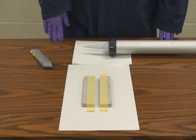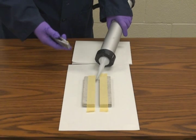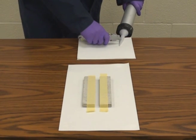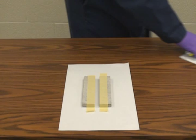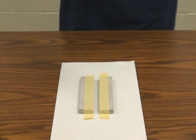The first thing you're going to need to do is to cut the nozzle to fill the gap. To ensure a proper cure, the depth should not be greater than half the width.